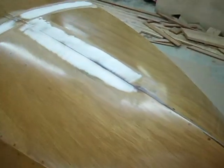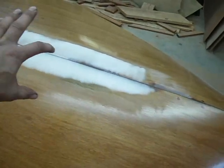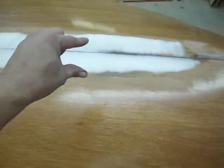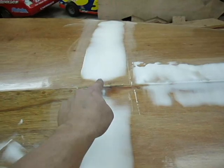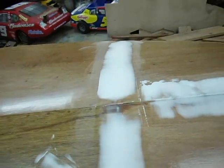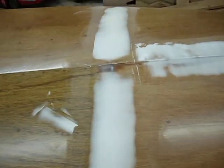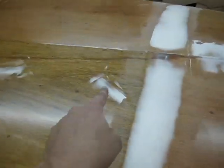So this is what we've done today — along these seams you can see where it's shiny and not shiny. I prepped all of this about 5 inches out with 80-grit on my random orbital, then I mixed up some micro balloons and spread it out on each side as fairing compound, same with this seam here. You can see it's spread out pretty good on each seam, and right up in here where there's nothing in between it was actually really flat across there. I tried and tried to fill that blank spot but every time I'd squeegee it off tight it would disappear — meaning that's really close to perfect right there — so just a couple little spots here where there were tiny little pinholes.